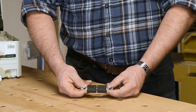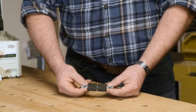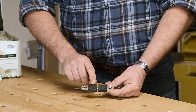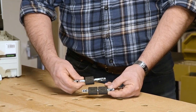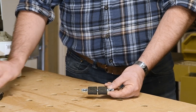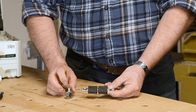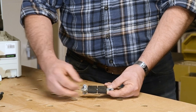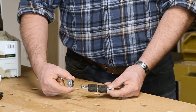The first part of the system I want to show you is this two-sided post. This is a common way to use this system and you will get maximum joint tightness with both sides being drawboard tight. You can use the plastic clips as seen in the middle here in two combinations — either one on each side or one in the center. It does not affect the strength, it is just for alignment purposes. The next components you need to complete the joint are these metal anchors and the bolt that goes in to lock them closed. They go into perpendicular mortises and when you tighten the key with the supplied Allen wrench it will draw the joint closed.